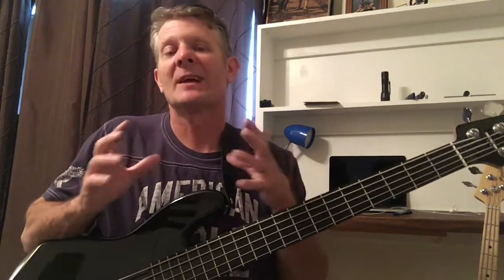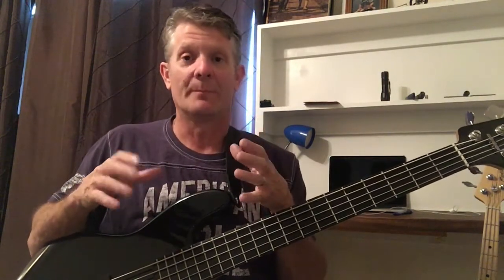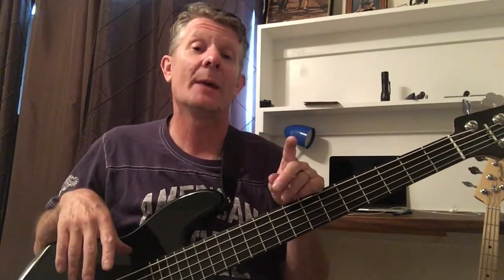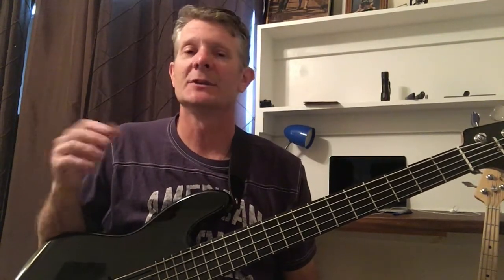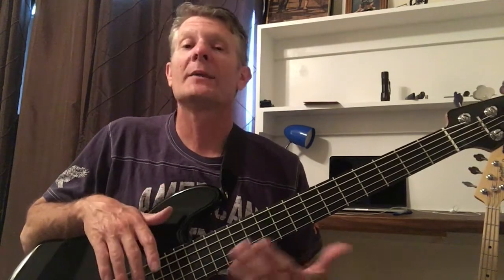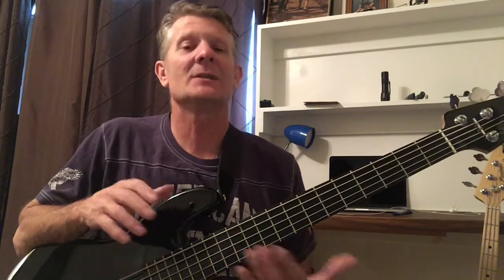You've got this situation: an 8 ohm cabinet, a 4 ohm cabinet. But another good thing about the 8 ohm cabinets is that most of your heads have 2 outputs on them. You've got 2 Speakon lock nut outputs, and they can go to 2 different cabinets. So if you've got 2 8 ohm cabinets, you're going to get the full 500 watts right there. But if you've only got one, all you have to do is run the one cable to your amp like normal, and you're just going to get 2/3 of that. So that's it. It's not a whole lot to it, but now you know what to look for when you're searching for your amp, and you've got to do some research.